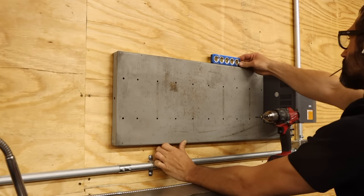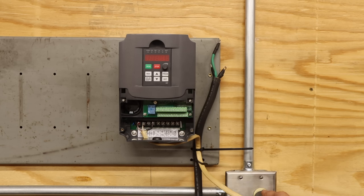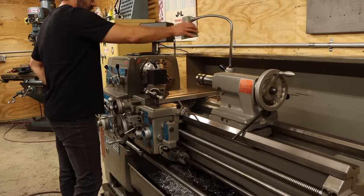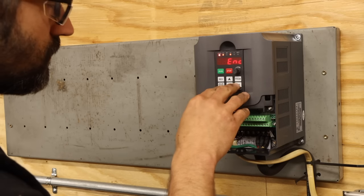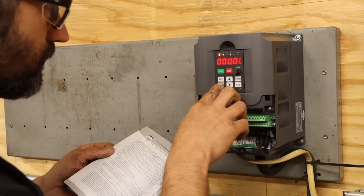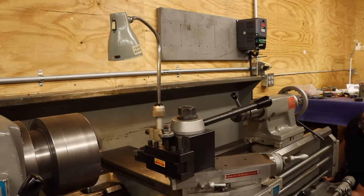The manual isn't very clear if this needs a separate control power, so the simple way to figure this out is to wire it up and see. That answers that question. Now the output terminals, which I'll connect right to the original lathe power cable. The work lighter is getting power, which is promising, but of course the motor doesn't start. Not exactly surprising, since we haven't configured any of the VFD parameters yet. There are hundreds of parameters, but since I'm only using this to get three-phase power, I'm just setting up the ones relevant for my application. To see if this is actually working, I'm manually overriding the motor contactor and pressing the run key. Success!